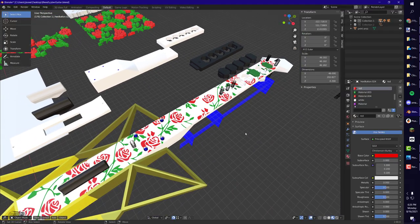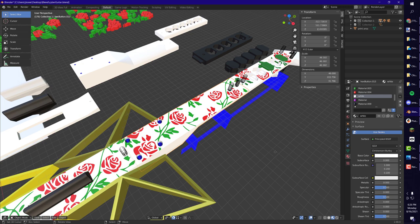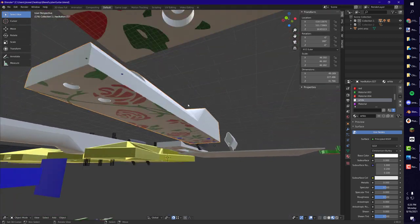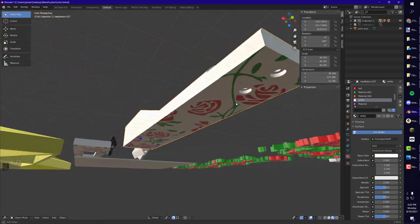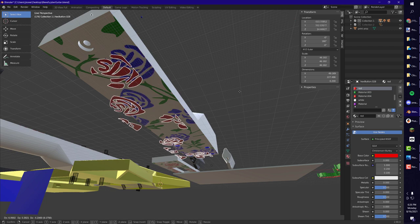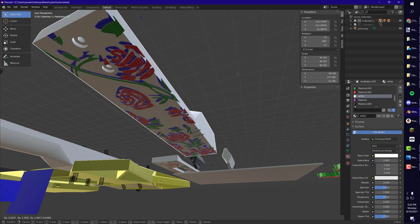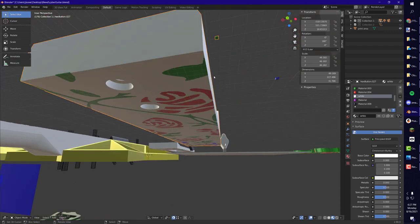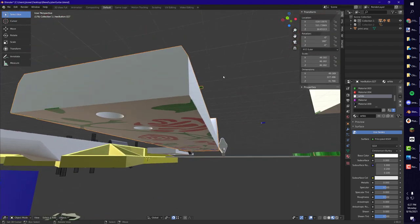Now, if you want to do multiple colors on the same layer, I don't have any sort of multi-material upgrade in my printer, so I have to do it in different prints. For this specific part of the neck, it prints upside down like this, and it's actually three different files. So there's the green file here, the red file, and then the white file, which is the rest of it. The green and the red are both one layer high, which in this case is 0.2 millimeters.